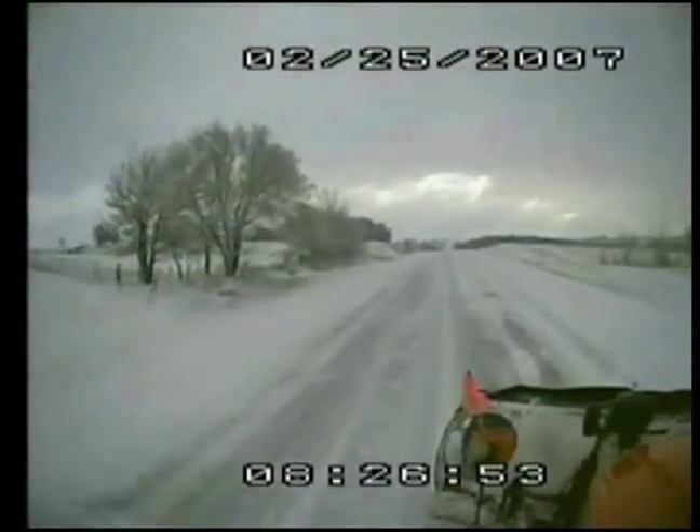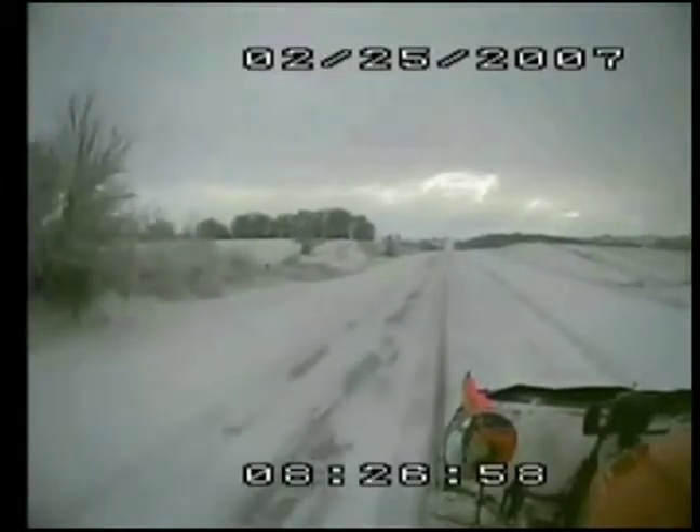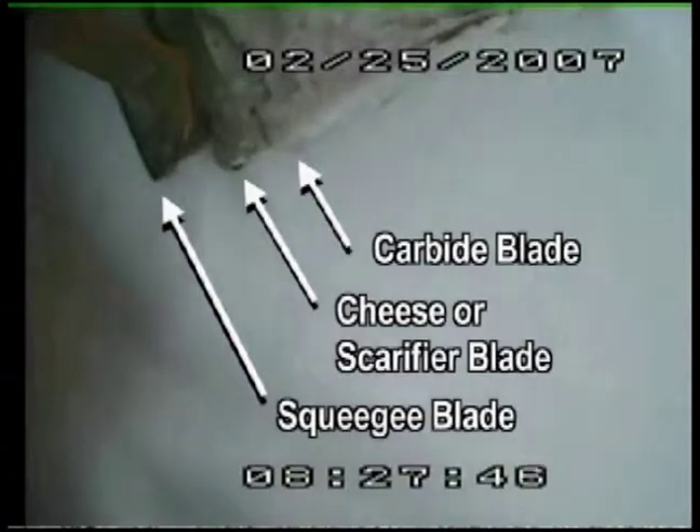In this view, you can see that the road's not looking too good. The wind's been blowing snow straight down this road all night long, and it's trying to get really stuck. As you can see, as this snow gets bonded well to the road, we don't have quite as much material coming off any of the three edges, but yet we still are picking up some snow from each cutting edge in contact with the road's surface.